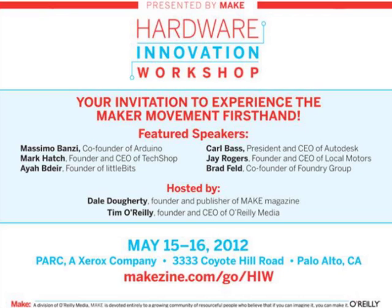Fabian, Bertrand. Yeah. So not at the moment. I mean, one thing that needs to be well understood is that we're working over an SPI bus, and to manage displays that have high resolution, well, it's not ideal. So there are some constraints that we are living with, meaning a serial bus versus a high parallel bus that would be required to manage very large resolutions with a lot of depth per pixel. So there's no plan for that right now.